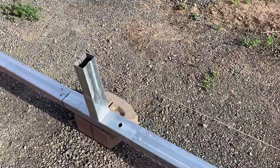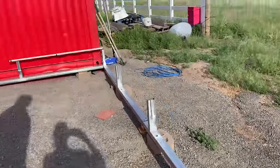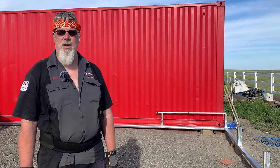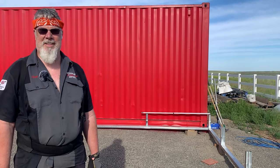And then on these holes that she's looking at right now, those will have ground or rod anchors, 3 foot anchors put in there so the wind can't blow out the back of the building. Right, and that's our plan here, to attach this whole building to the containers because we live in such a windy area. That's why we're not using a foundation of sorts, because our shipping containers are 10,000 pound anchors each for the building, and that's our assumption.